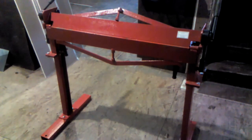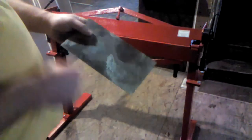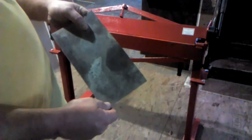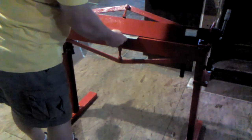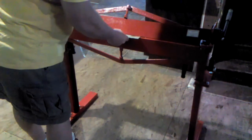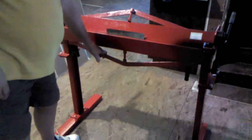First thing, I've got a piece of sheet metal and I've marked it — because of the size of my shear and convenience — an inch and a half from the edge. That's where I'm going to start my first bend. I'm going to put my sheet metal in up to the mark, lock it down, and bend it just slightly over 90 degrees, like so.